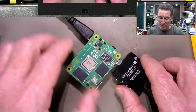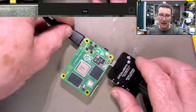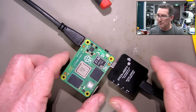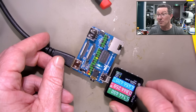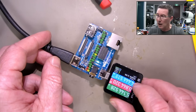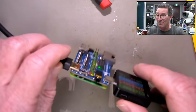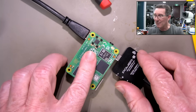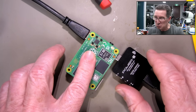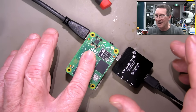I think that's a loser all around. We could have damaged our power supply. It's still delivering 5.1 volts. We were getting 6 or 6.5 watts before - that means there was a good couple of watts going into that chip, which is why it was getting hot. More than double, maybe even triple its stated consumption. The processor's doing something - it's about 40 degrees, and my finger's starting to act as a heatsink. Not getting anything out though, unfortunately.